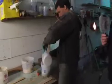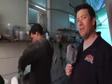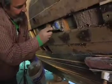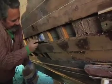While Bob is doing that, Noah over here is blending filler into the mixed epoxy to thicken it up so that we can put the thickened resin system — like a putty-style material — into the seams and where there's space behind the planks, so it fills everything. When we put the screws in, it'll pull up tight and make a nice smooth pudding consistency. There's nothing really scientific about this technique — just try to get plenty on there and keep most of it off the ground. What looks like chunky peanut butter is some old wood flour they mixed into it, and it'll glue up just fine.